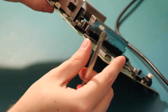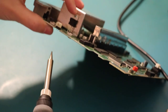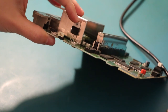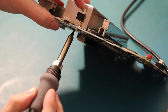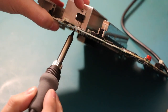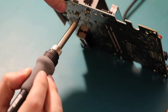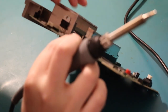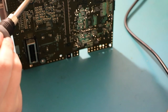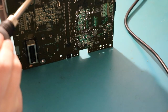Get an idea, so it needs to go down a little bit. So I'll just heat up that one leg that we tacked. Which was the first one? I think it was the first one. Soldering iron still on? I can't see what I'm doing. That was too much! No! Oh, the joys! Oh, perfect.